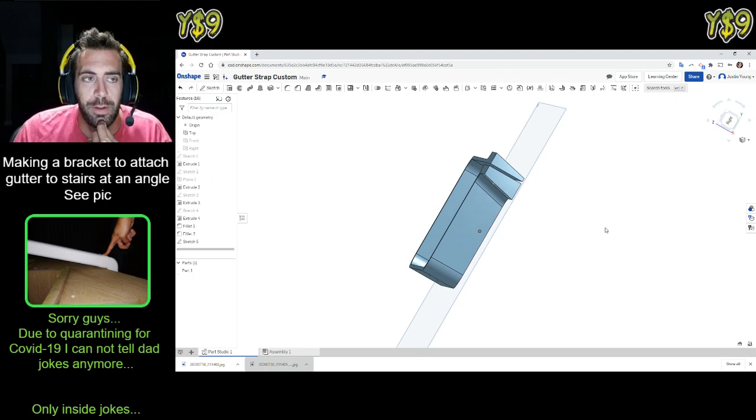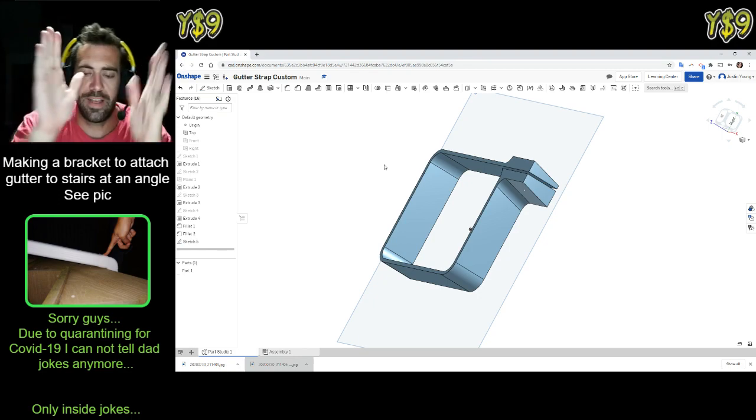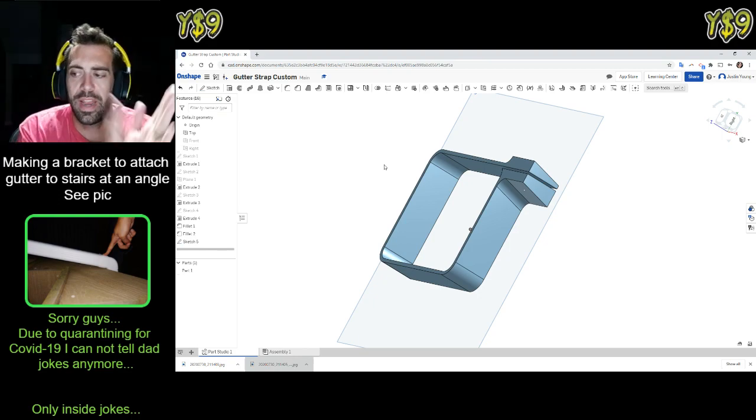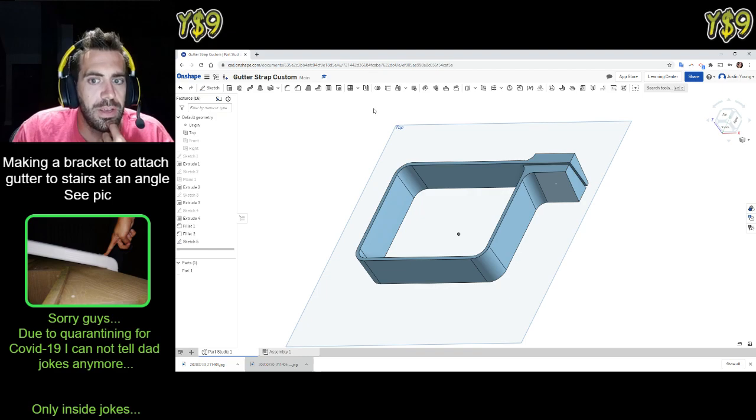But I probably have some small panhead screws I could use. Because if I countersink it, it's not going to get as much pressure. I want something that's going to be flat instead of having that 82 degree angle that you have on a countersink. So I think I might want to counterbore it.